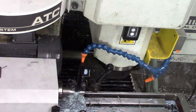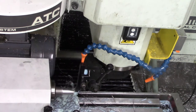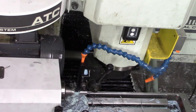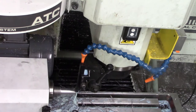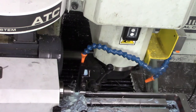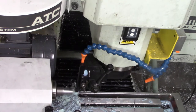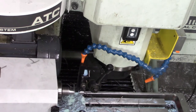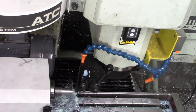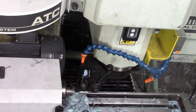I always imagine what life would be like if I had a Haas Mini Mill and a real CNC lathe — what could I do with those? Of course the first problem is I'd have to fit them in this tiny little shop. Just continuing along, taking a very small depth of cut — I think I'm taking 50 thou per pass, 6 thou per revolution feed rate, 1200 RPM. Actually, the Rapid Turn compensates — it's actually programmed for surface feet per minute, and it increases RPM as the part diameter is reduced, maintaining constant SFM. That's a cool thing.